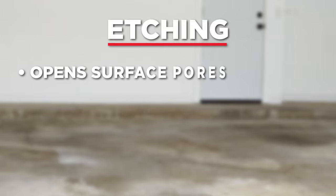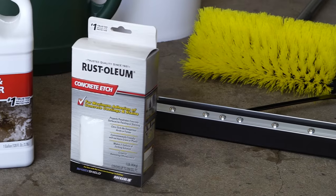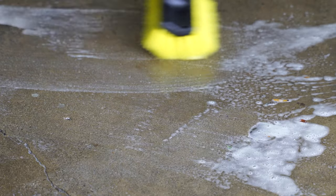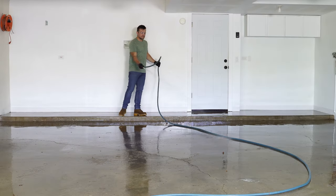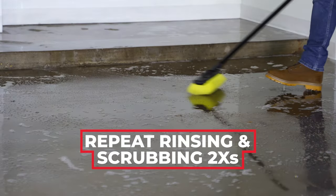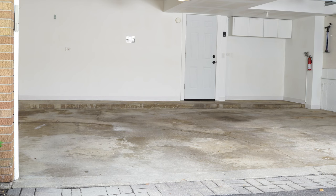Now you're ready to etch the floor. Etching is a process that opens the pores of the surface and ensures maximum adhesion of the new coating. You'll need to do this to any areas of exposed concrete where the previous coating or sealant has peeled or flaked. Slowly pour the entire concrete etch into a large watering can and add two gallons of water. Sprinkle the solution and scrub with a hard-bristled brush. The etching solution may fizz for a few seconds while being scrubbed — that's a normal part of this process. Once the fizzing stops, rinse with clean water while scrubbing the etched areas. If you don't experience any fizzing, be sure to wait a minimum of five minutes before rinsing. Repeat the rinsing and scrubbing steps two times to make sure no solution remains on the surface. Squeegee out any remaining water.